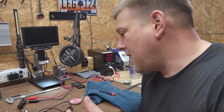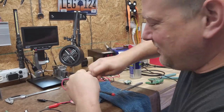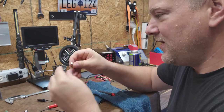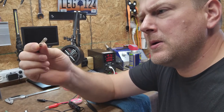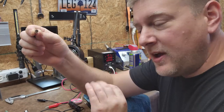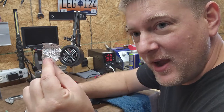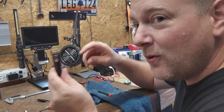There's one other thing I have to do — if you remember from video one, one of the very first things I did was foil-wrap the fuse. So now I have to go get another fuse — maybe a one-and-a-half amp. It had a three amp originally, but since it runs perfectly fine on one amp, I'll probably replace it with a one amp in case I have any electrical problems going forward. Just a reminder: if you ever foil-wrap a fuse, remember to disconnect it — and don't foil-wrap a fuse.